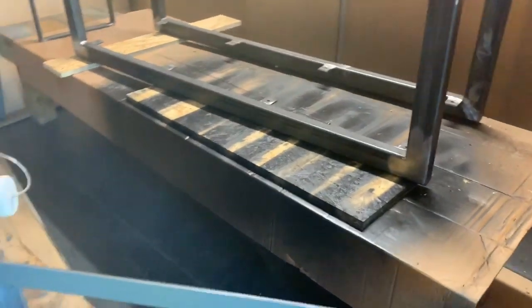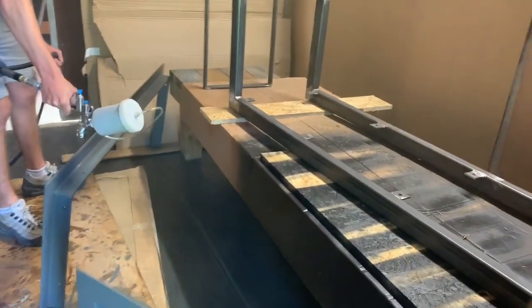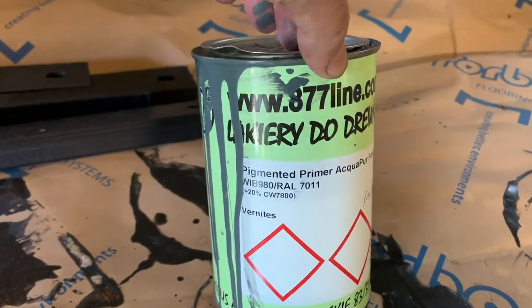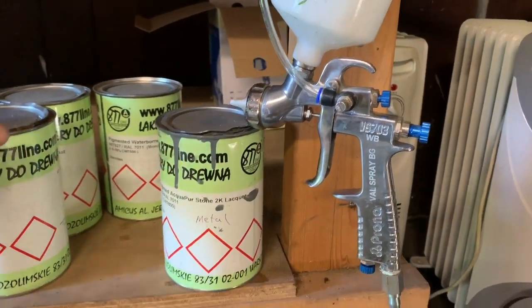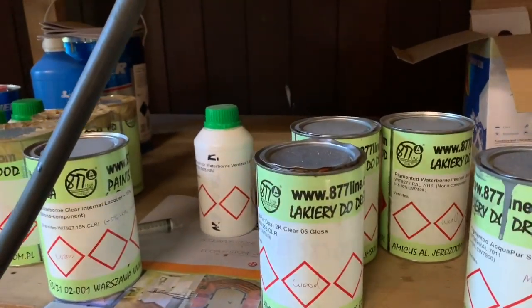Welcome to another shop talk. We're doing some spraying today of the metals — have a look — with two-pack water-based undercoat. This is the Aqua Pure product; I'll put a link in the description. Rob's website set up the non-pressurized gun for us, all ready to go. You can use it on wood or metal, they're all water-based, so really good for us right now without any extraction — no fumes, and it dries absolutely solid.